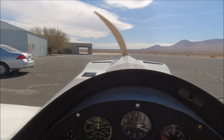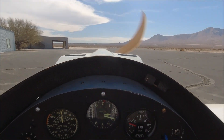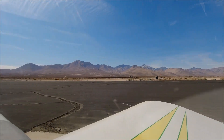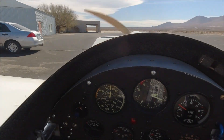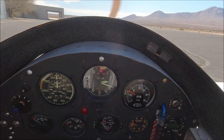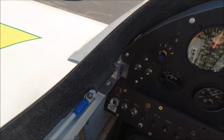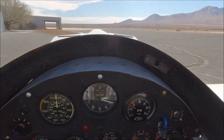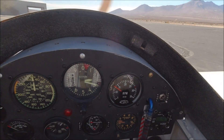Going back to that 45-minute flight — I'm looking to fly a little bit longer. This will be the second flight with the modified oil breather. The crankcase breather is now coming out of the dipstick tube instead of off the rocker covers, where it was before, which we found was causing a huge oil slick on the belly and an oil loss rate of about one and a half quarts per 20 minutes. The last flight was about 20 minutes long and I lost no oil, so on today's longer flight I'm hoping to also lose no oil.